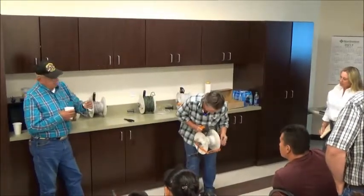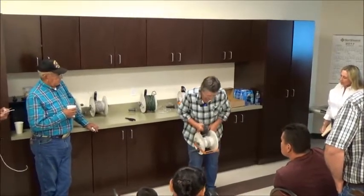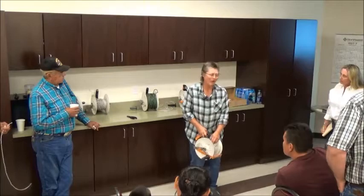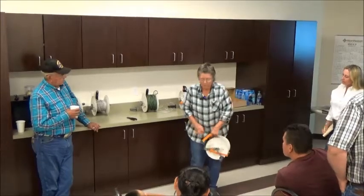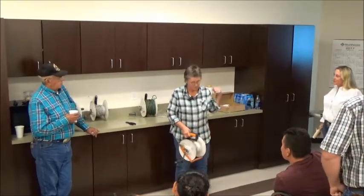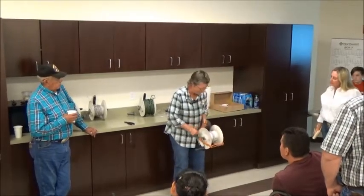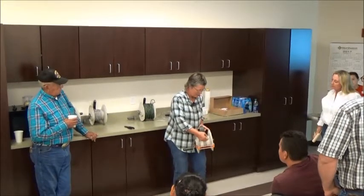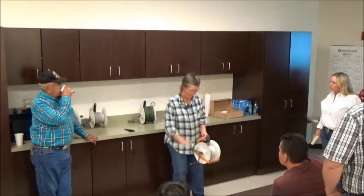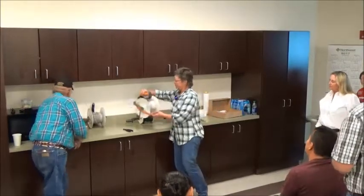But I brought this to show you, and I wasn't sure I'd be able to show you. In the inside of a reel is a place to hook your twine. All right guys, don't tie the twine on. You know why? Because when you're driving along holding this twine and it's reeling and you get to the end of the reel and it's tied onto the reel, you're going to wrench your shoulder or the twine reel's going to fly out. You want that twine to come off. So just slip it in there, just enough to get the reel started reeling. Do not tie anything to anything ever. I guess you can tell I'm pretty emphatic about that.